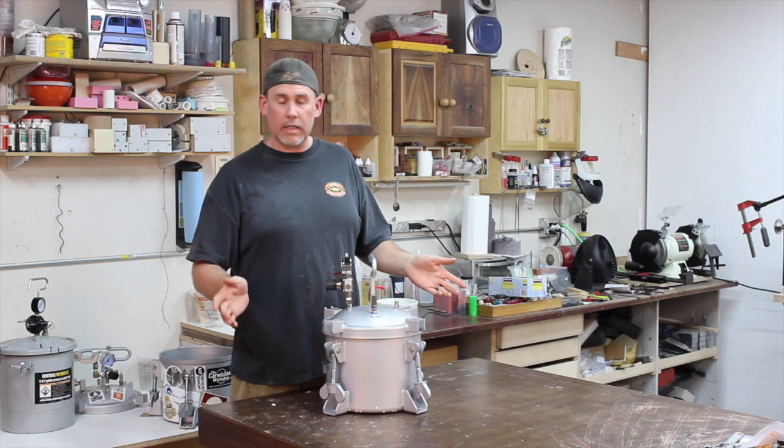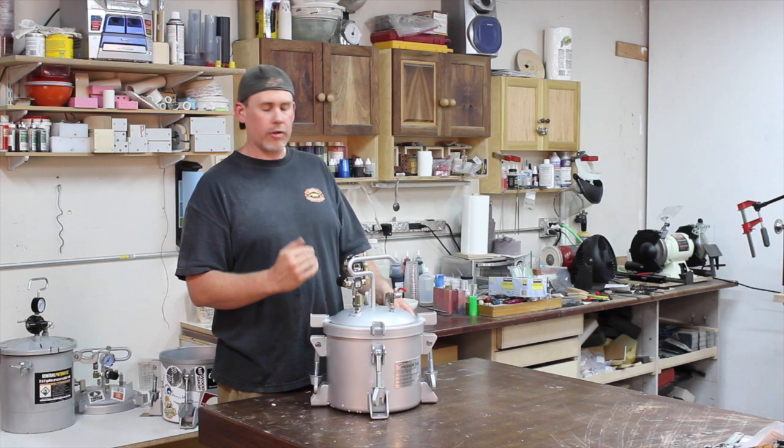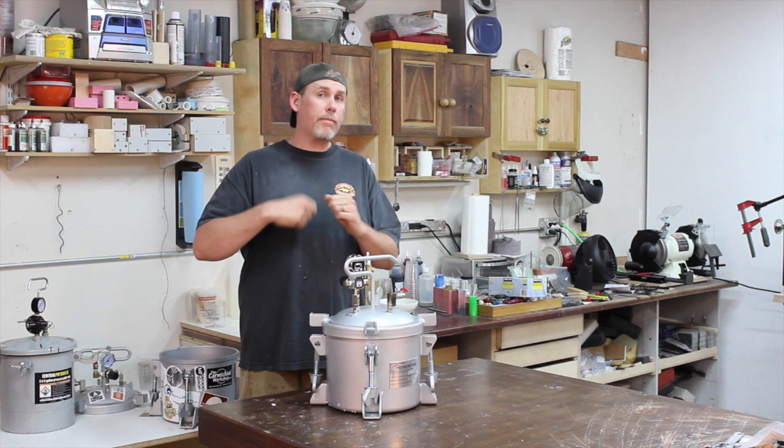You're probably not going to have a massive leak. It's probably going to be a slow leak. And so I just keep an eye on whether it's holding pressure or not. If it's not holding pressure, you obviously have a leak somewhere, and you'll just have to use that spray bottle method or whatever. What you'll have to do is take that joint apart, tape it real well, and then maybe tighten it harder.